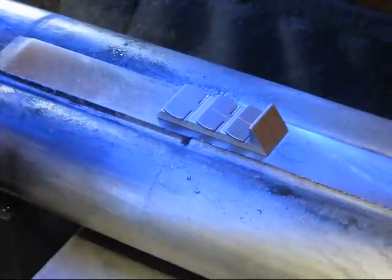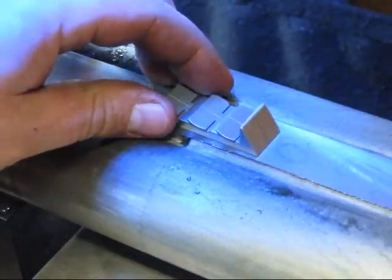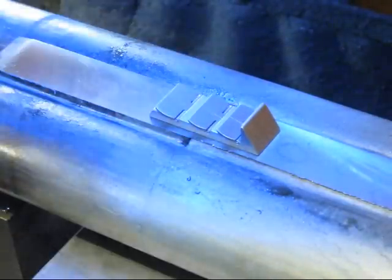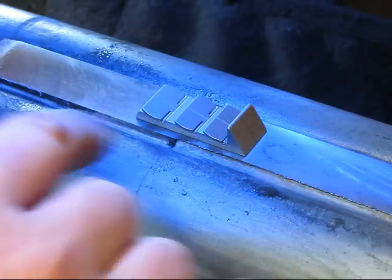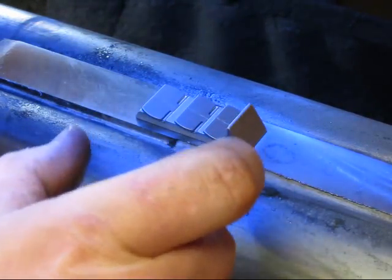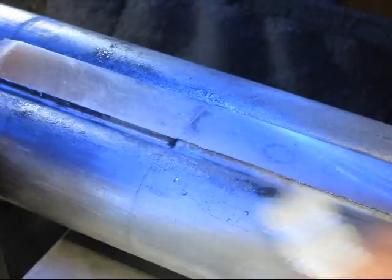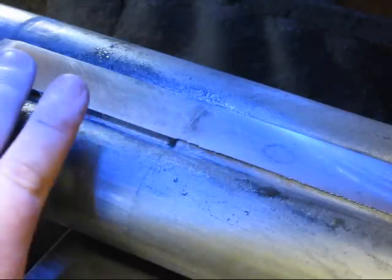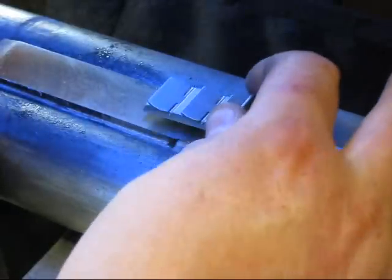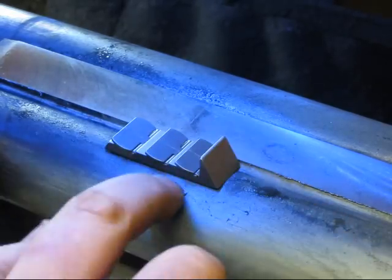You can see I've got my quarter rib machined down now. What you'll notice is I've got the express sight just sitting on top, approximately where it's going to go. What I'm going to have to do is machine across this and remove some depth to get the express sight to drop down in there. But because of how shallow this quarter rib is and because these barrels don't have a defined profile to them, this quarter rib sits just barely above the barrels, and by the time I machine down to make the dovetail for this...